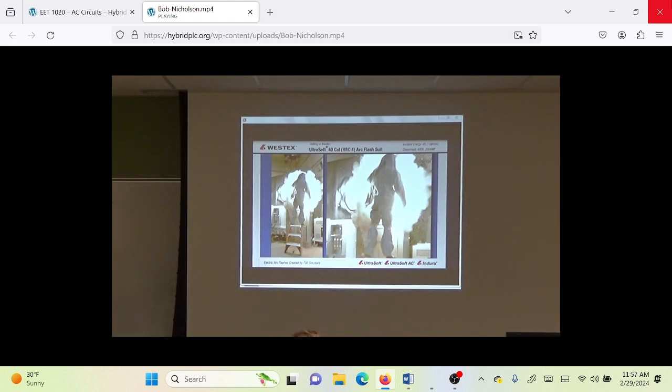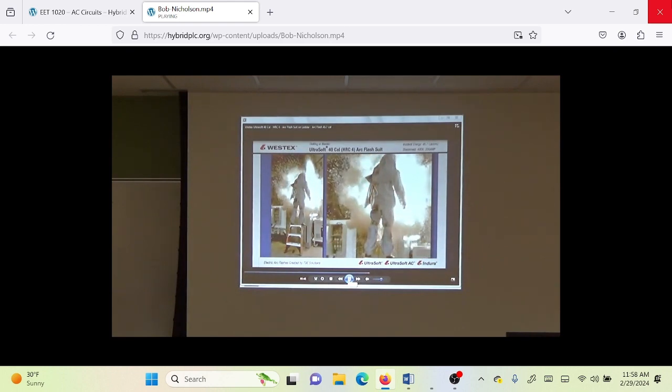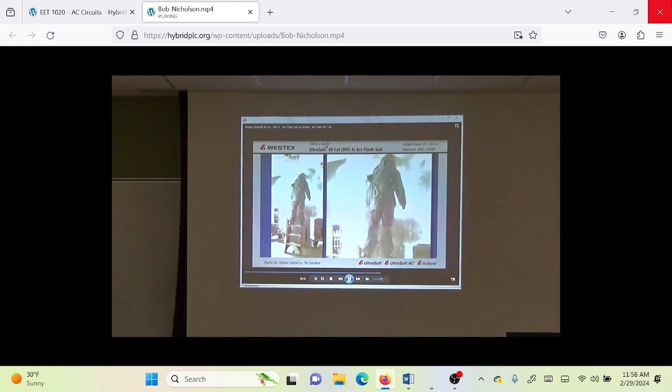So this is going to go on for a while until something turns it off. The previous clothing would not withstand this. This clothing is much thicker. So this isn't a good place to be, but... Oh, there's a wall of molten metal going in all directions, and the arc eventually defeats the sides of the MCC as well, and we get the arc plasma out to the right and left of the mannequin.